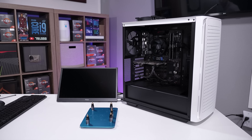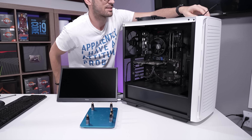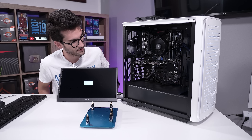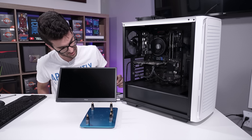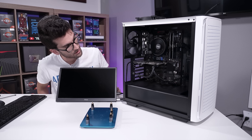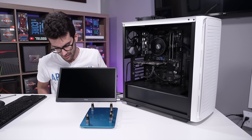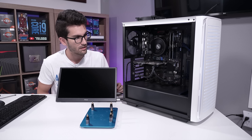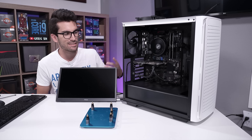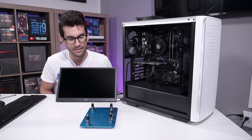Now I'm just going to connect the card again without a cooler — don't try this at home. I'm not expecting this to work. Six-pin supplemental power connected, HDMI behind the card. Power the system on and cross our fingers. The light is still on over the PCI connector. Not seeing anything — just a black screen. I think we have a bigger issue with this card. That's a bit disappointing, but I'm not really surprised. It's going to show, obviously, that it's not going to fix every graphics card problem out there.